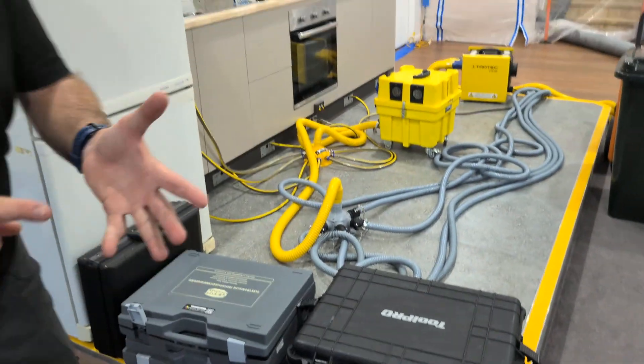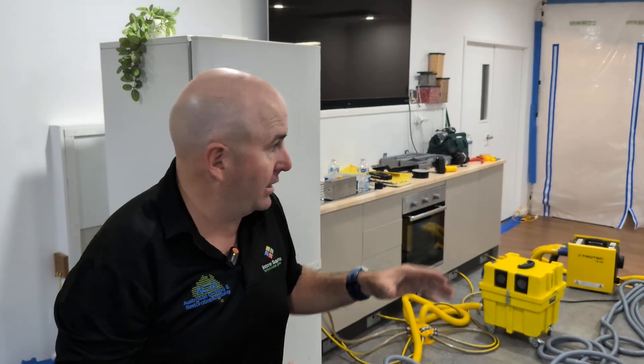We've been right through moisture detection today - from microwave meters to stainless brush pits in the concrete. We did insulated rods with conductivity paste. We did in-depth hygrometer. We did non-invasive for timber. We did invasive for timber. So we did a lot of methods on moisture detection, as well as showing how to change this setup around.